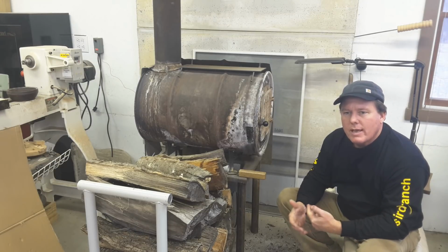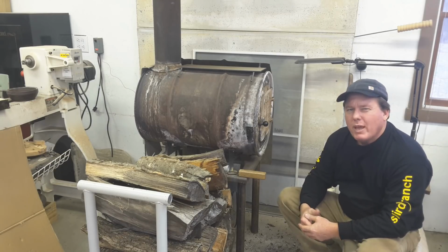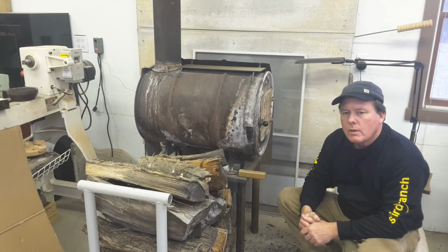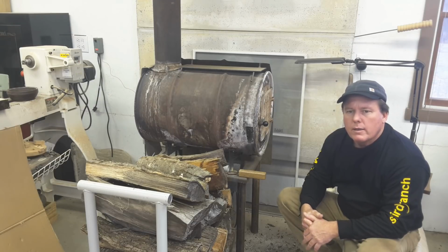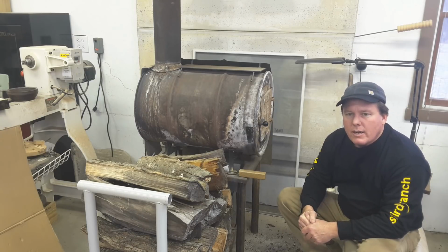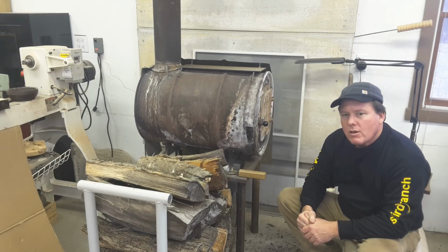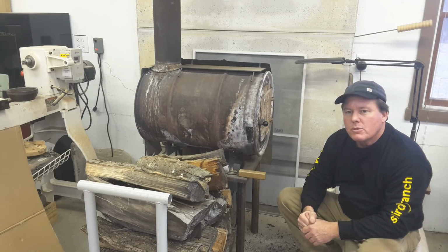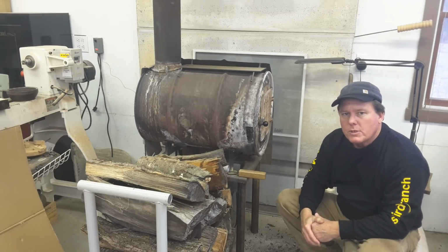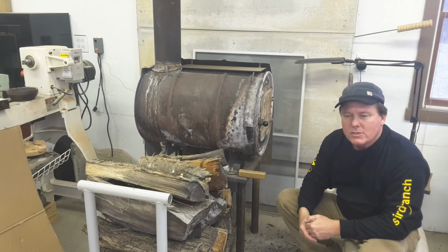I decided I wanted kind of a black oxide finish. I didn't want it to be a painted-on surface coating. So before I left on a business trip, I took the legs down to a sandblaster and had them sandblasted. I could have done it here, but I was kind of crunched for time. And for the 60 bucks it cost to do the two legs and the I-beam stretcher, it was well worth it. So with the legs all prepped, I'm going to try doing the blackening of the steel.